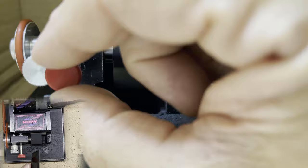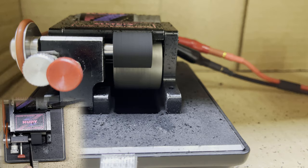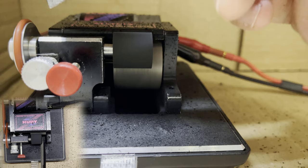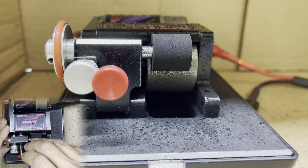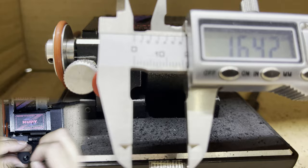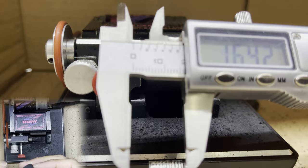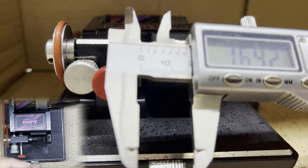I've now reached my stop, so that's just free running — the amps have pretty much returned to what they were before, and the tyre is clear of the drum. I've wound it back off the drum and I'm just going to trim the edges again with the diamond plate to make the tyre slightly narrower. We're now down to 16.4mm width, which is very close. The tyre will probably contract a little as it cools, so I don't want to go all the way down to 16 — take it slightly over, and leaving it slightly over width also means you can trim and have fresh rubber on the sides.